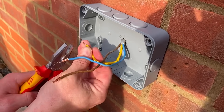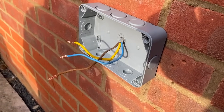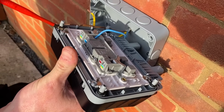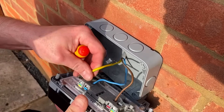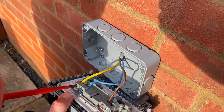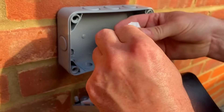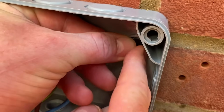I always like to double over the terminations, especially when there's only one cable in there. The line conductor first — a nice neat doubling over gives it more material for the screw to bite onto. Then the neutral, and the CPC — the circuit protective conductor — also doubled over. We can now bring in the color-coordinated terminals; they're also captive so they won't fall out. Nothing worse than dropping a screw outside — it hits the floor and bounces in completely the opposite direction to what you'd expect, so that's a nice touch.